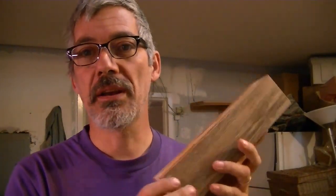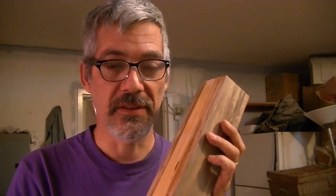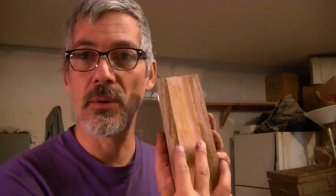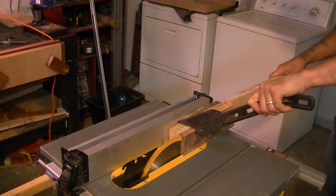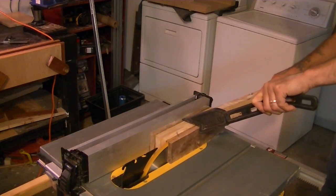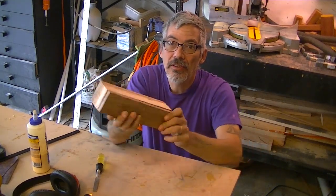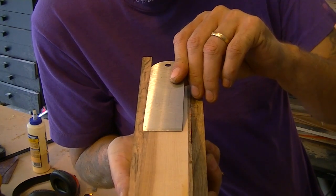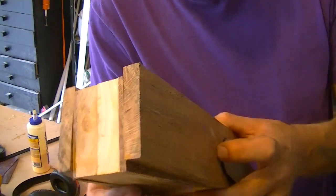My block is dry, but I wanted to explain why I didn't cut my angles — the throat first — and whatnot. Very simple: my blade is actually a little bit wider than the two center boards, so I have to rip this whole thing just a little bit further and glue the outside panels again once I've cut my throat out. I just finished ripping my pieces on both sides — now my blade can fit in between, no problem. Once I cut out the throat I can clamp and glue everything together again.